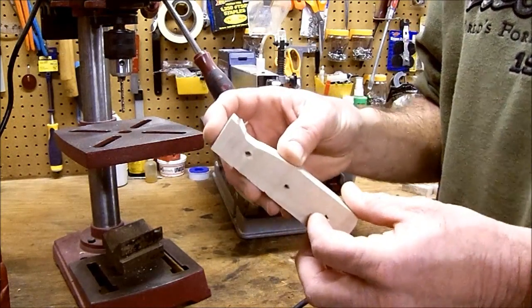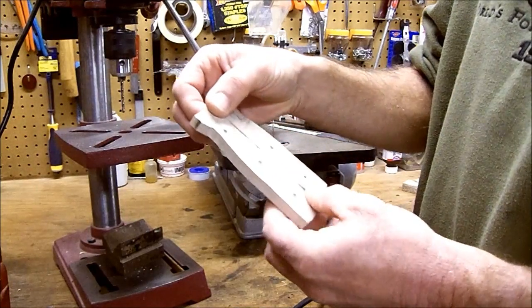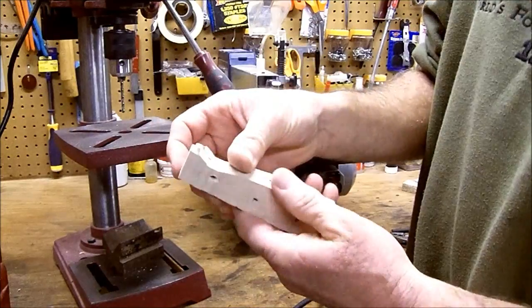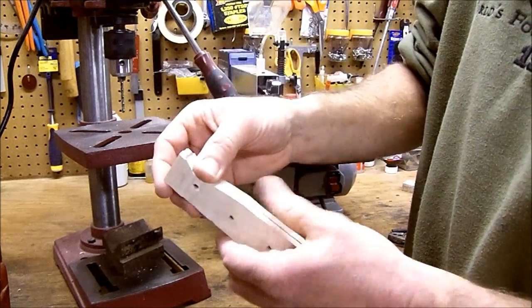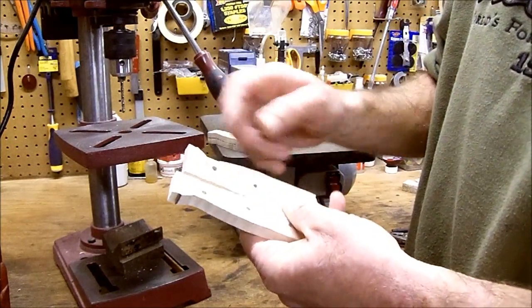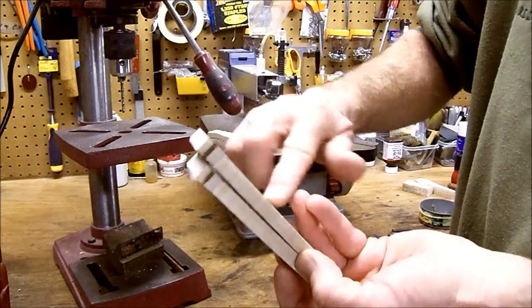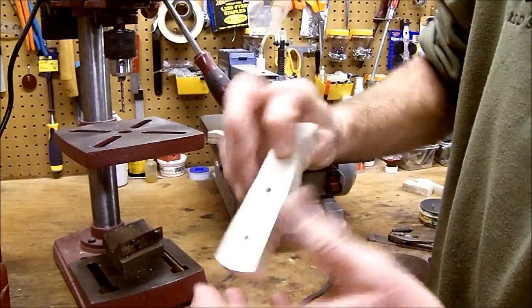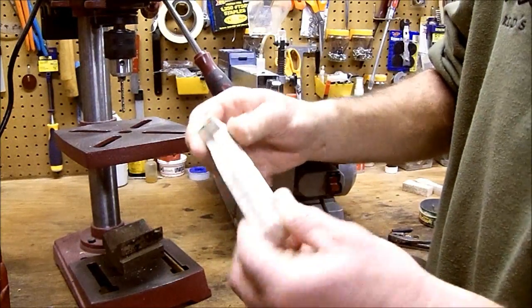When you buy them, if they're buying a better cut and they start talking book match set, that's all it is right there. Took a 1/64 of an inch out of the middle of them. Both of them are identical. You can't get any closer than that. When we glue them up, we're going to go back to our factory smooth on the outside. We're going to glue them together like that. Perfect glue joint. This is the side that's going to get worked. They're going to be identical.